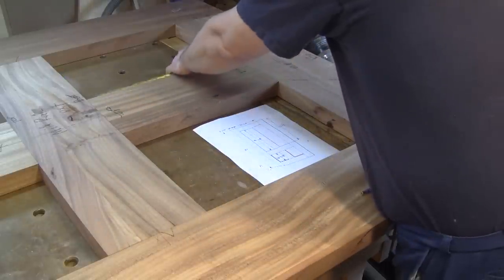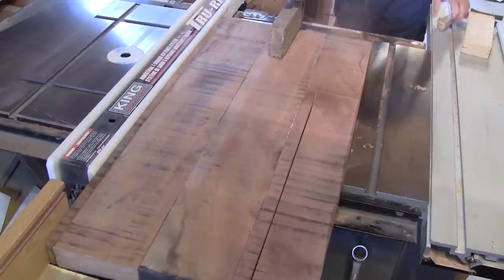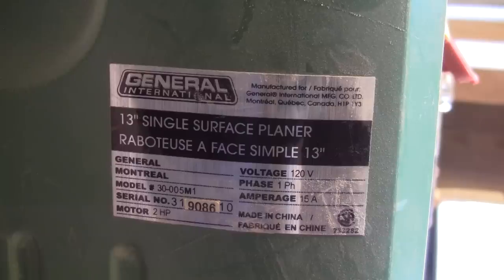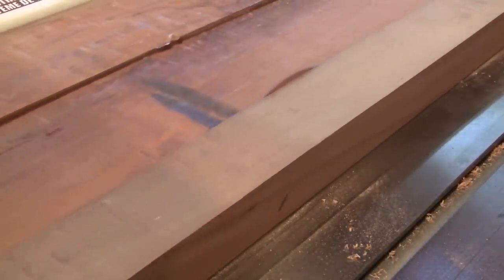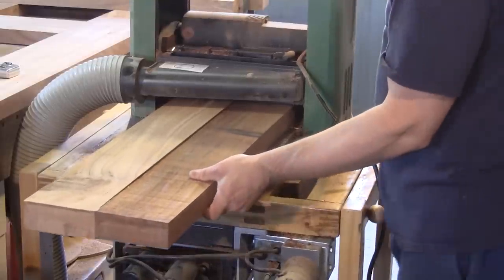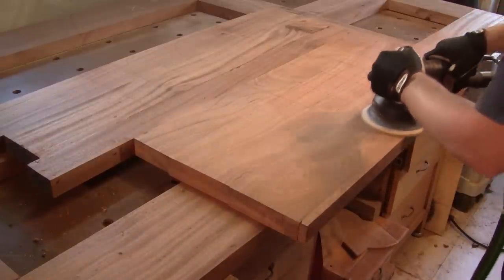Then I measure the raised panels and cut them. But when I try to plane the second face, I realize that the panel is thirteen and a quarter inches — but my thickness planer can only take thirteen inches. So I re-cut the glue-up on the glue line, then it can go through the thickness planer. Now that all the pieces have the same thickness, I re-glue them together. When the glue is dry, I sand everything flush.